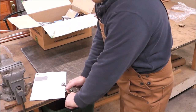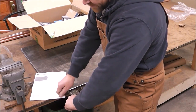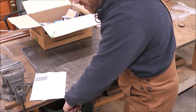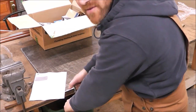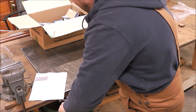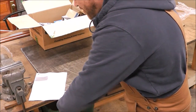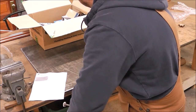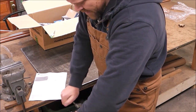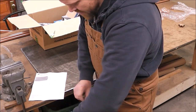For this pipe, I'm using what's called Type L copper. They make a couple different types — Type M has a thinner wall than Type L. Type L is considered heavy-duty copper, and that's what I'm using for all of this. I could buy Type M and save a little money upfront, but this isn't anything I want to be replacing anytime soon, so I might as well buy the heavy-duty stuff. Then it's good forever and I never have to worry about it.